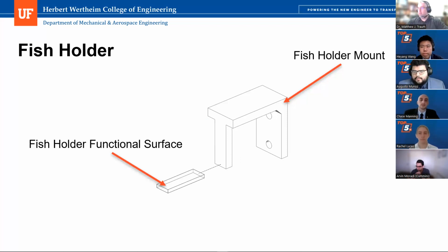Right. So one of the ways we designed this was we had three materials in mind: PLA, ABS, and PETG. Out of all of those, PETG had the lowest cost and one of the greatest water resistance. If we were to use PLA, it would just dissolve over time. But PETG is relatively water resistant, and if we show during some sort of testing of prototypes that there is an issue with repeated water submersion, we would likely spray it with some sort of sealant in the area to prevent that from becoming an issue. Okay, just something to think about.